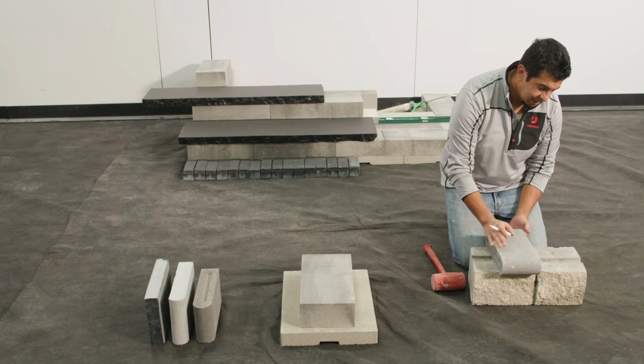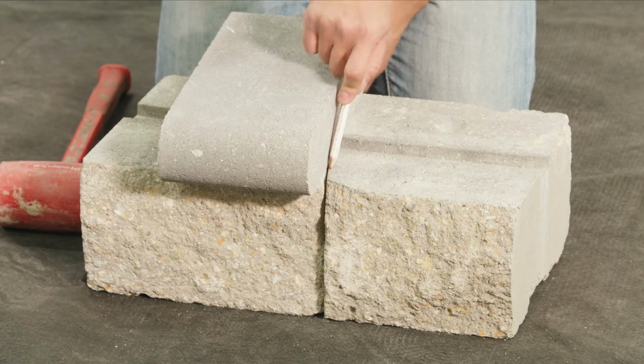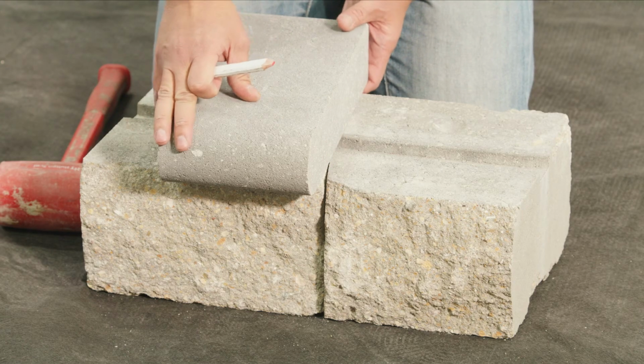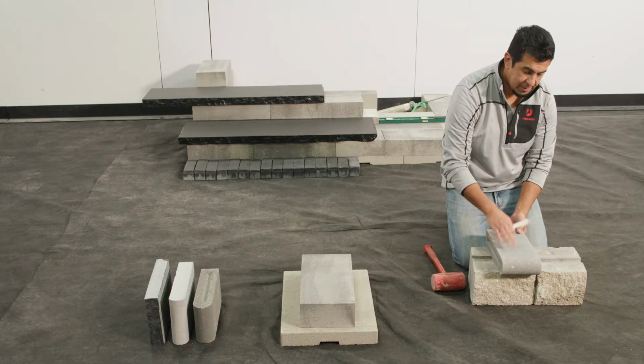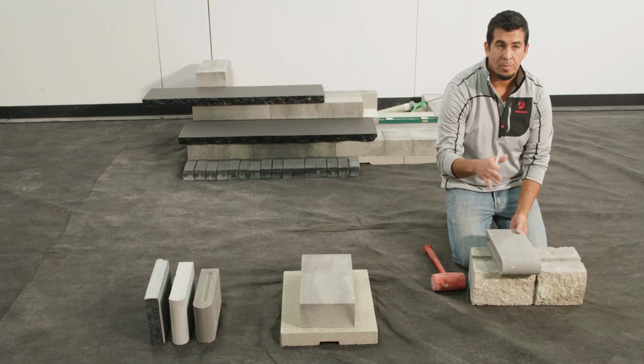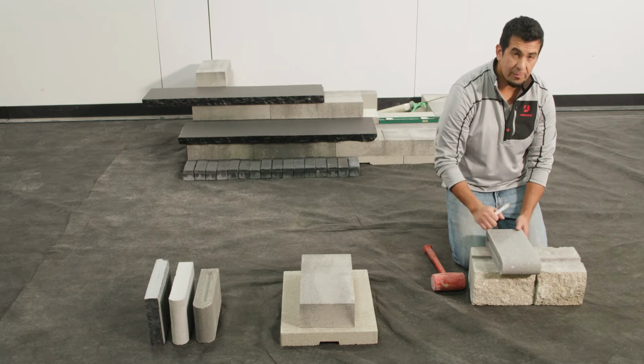What happens there is when we get movement on one of these units, if your coping piece happens to fall on that seam line, you're going to get a pretty easy movement on that coping piece where it becomes dislodged, and then you get a callback because coping is unsticking or ungluing from that surface.